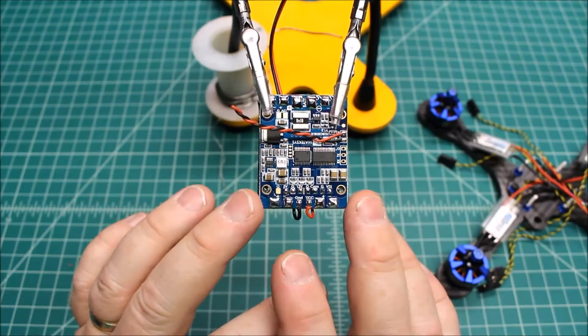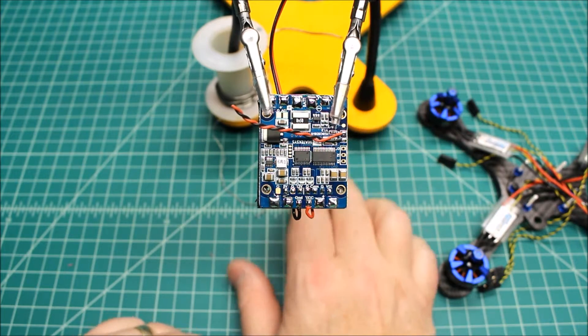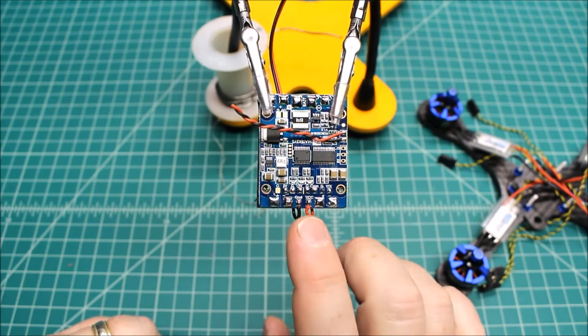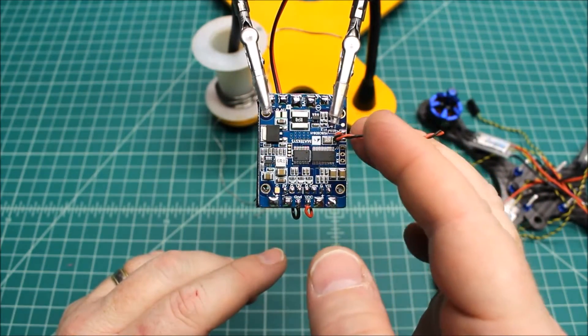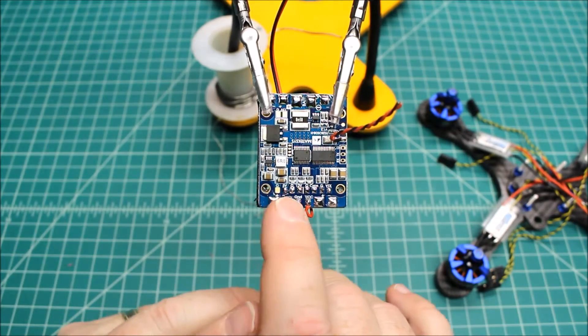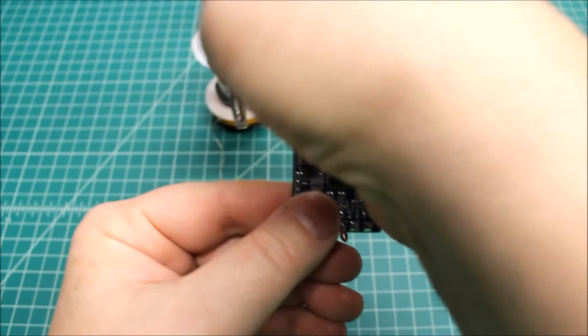When doing these builds I like to get as much wiring done as I can. I use these helping hands — the quad helping hands — and they really work well. The LEDs run off four-cell power so they run directly off the board. I'll run the 5V line to the F3 flight controller. I go ahead and wire up all the VTX and camera before I even get it installed, so when it's in, all I have to do is mount the ESCs and do the soldering of the flight controller.